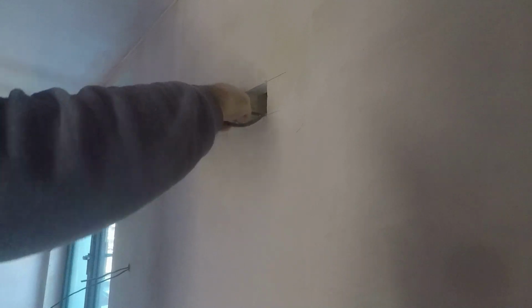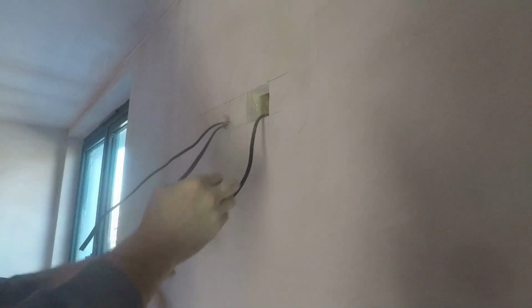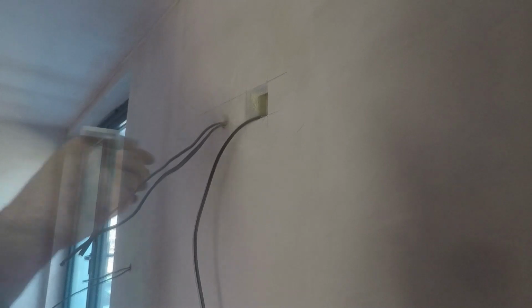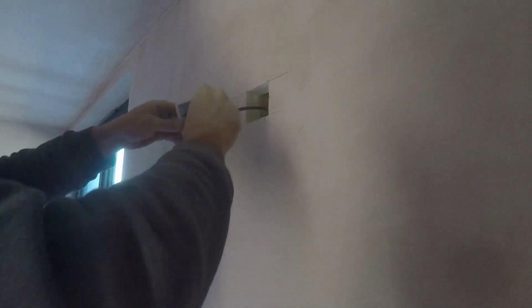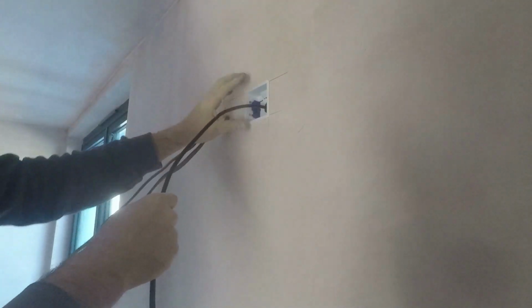And there you can see we've exposed it. Just threading the aerial back out. So all the cables run on top of the 100mm and below the 25mm. Just then, so if anybody is using fixings to go into the wall, keeps cables away from it.